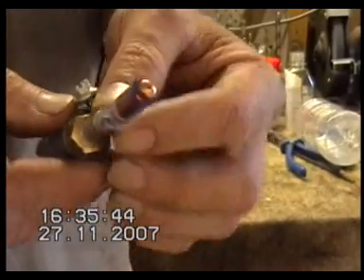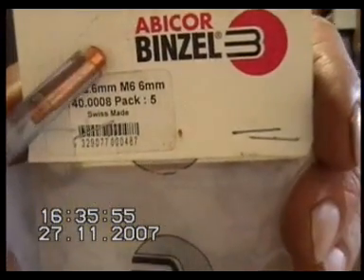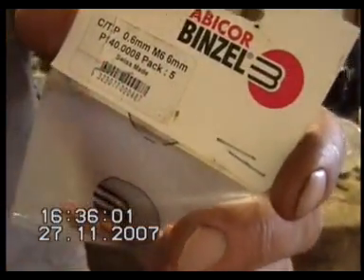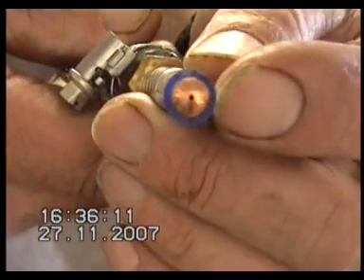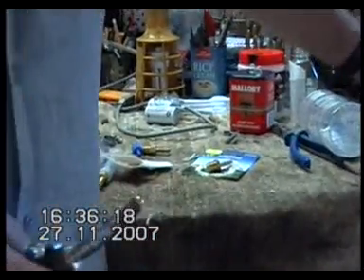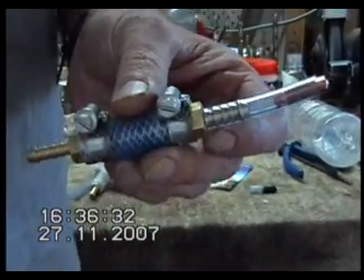The other thing I've got here that's working well is a MIG wire welding tip. They come in a packet — these are the ones I'm using. On there you can see they are 6mm outside diameter, so that's a tight fit inside the 6mm hose, and they have a 0.6mm hole in the center — that's a really tiny hole. You can use 0.6, 0.9, 1.2 wire and so on, depending on what size jet you want at the end. They work better than basketball fittings because the MIG tip already has a 0.6mm hole, which is pretty tiny. I'd strongly suggest you have one of those on the end of your line.